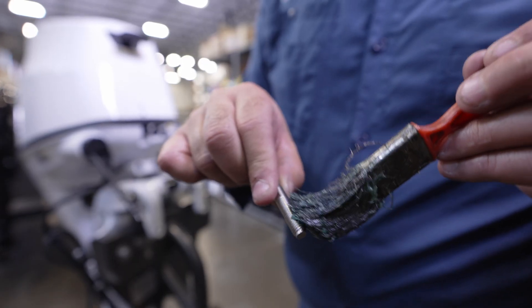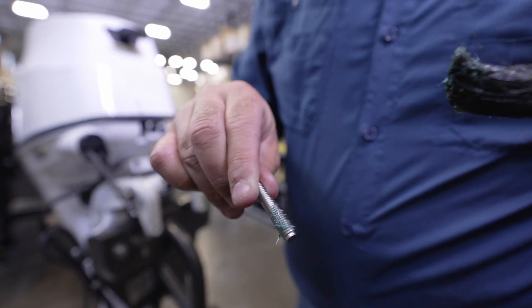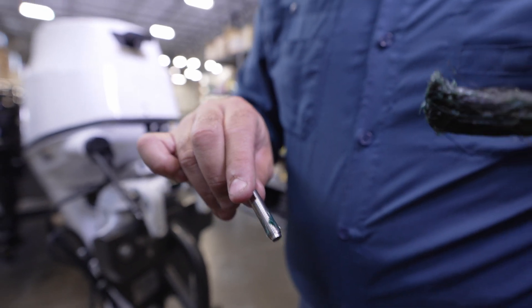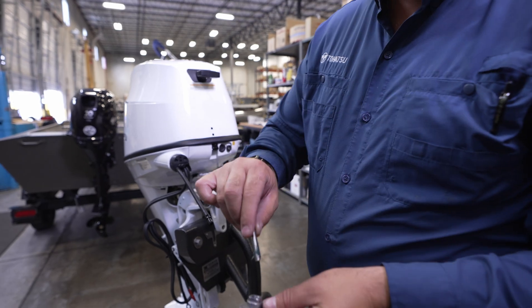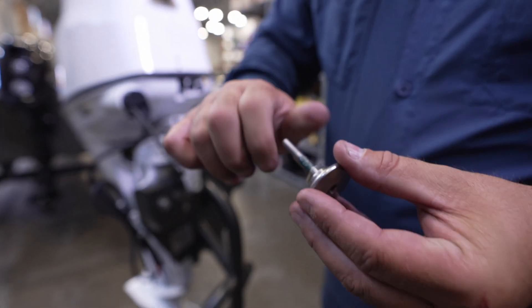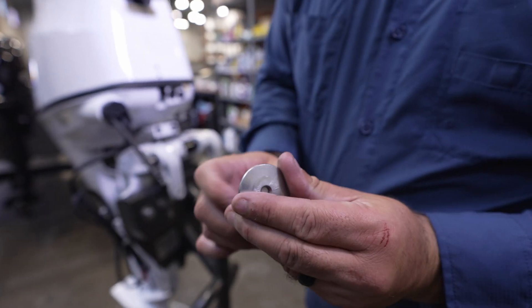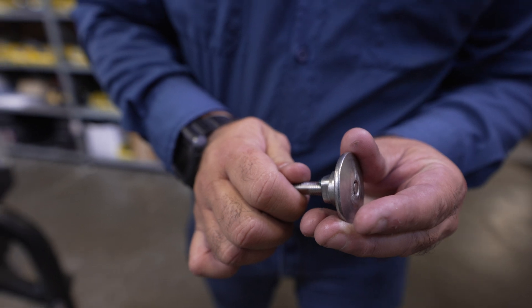Select item 6, which is a bolt, also known as a stud, and add a small amount of marine grease to the threaded end, but not covering the keyed end. Thread the stud into item 7, the friction lever bracket, with the keyed end on top, so that 25 mm of the stud remains exposed, or so that the bottom of the stud is flush with the friction lever bracket.